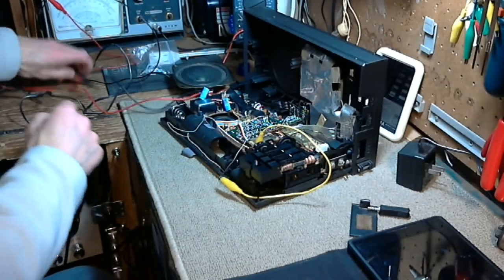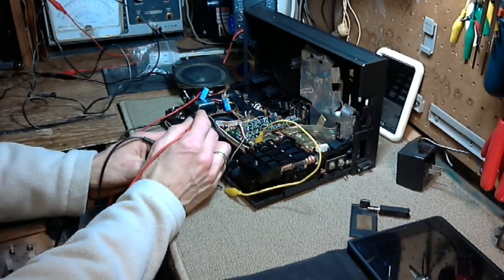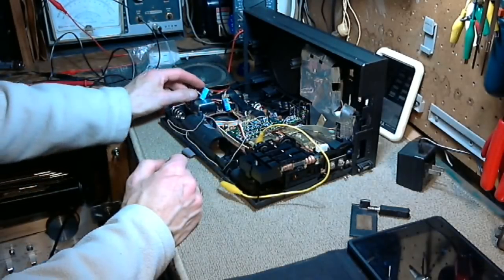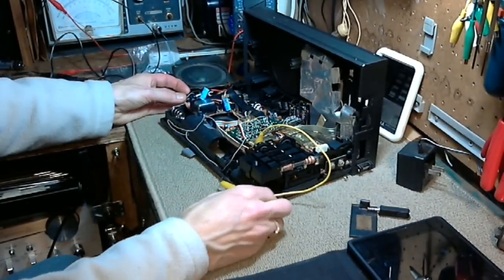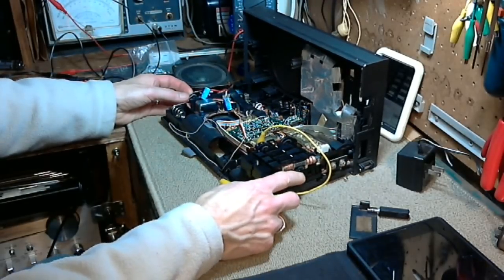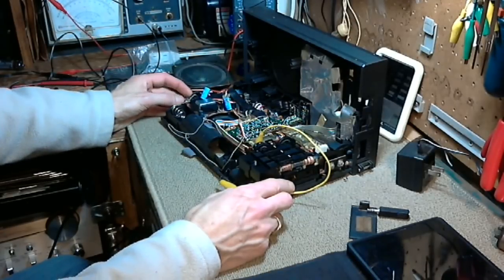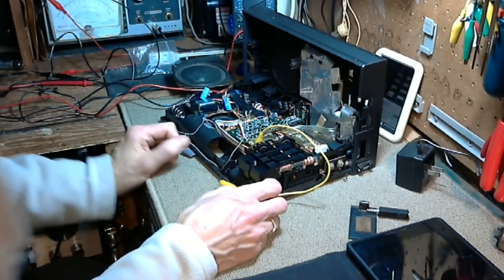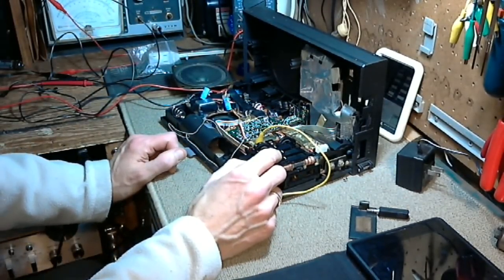Pull the power out. Check the 3 volts again, just to be sure. Okay, 3 volts are there. Now, if this is true to form, as I push this in, the radio will come on. Oh, shoot. Well, I could hear my power supply pick up a load. It's drawing current. Display is on, looks stupid though.